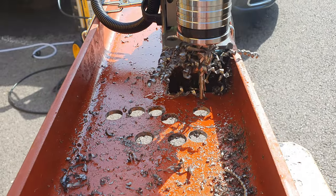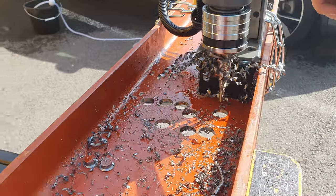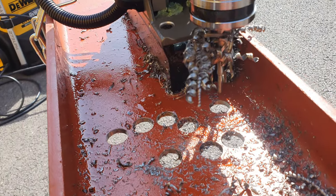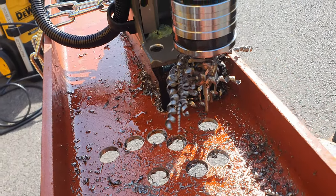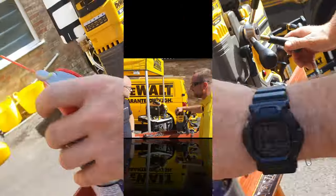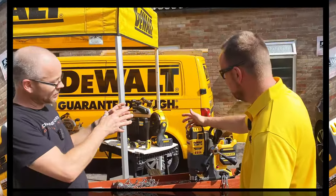And that was just straight through a piece of RSJ - that took about four or five seconds, absolutely nothing. The blades over the bit are all quick release, and it's great that you've got all those extra features and the benefits of changing the speed for that sort of thing.